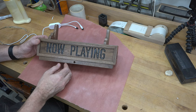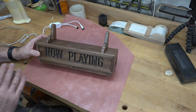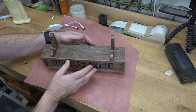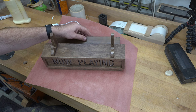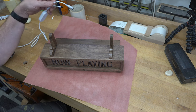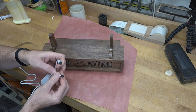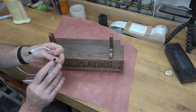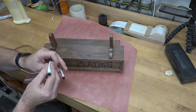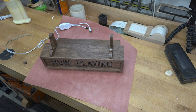I have applied several coats of satin finish water-based varnish and this thing looks absolutely beautiful. I'm now going to install the LEDs — they are peel-and-stick LEDs. I do have a tutorial on the channel for soldering if you need it, I'll post a link below. One detail: these cords are white, which means white rings are exposed when they protrude out the holes. I've taken some flat black paint and painted the ends black so they won't stick out like a sore thumb.